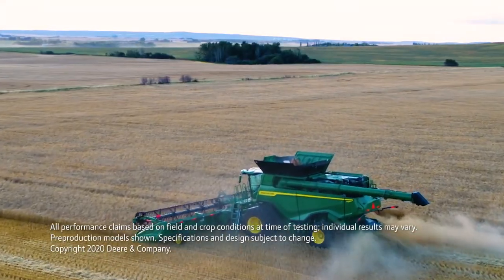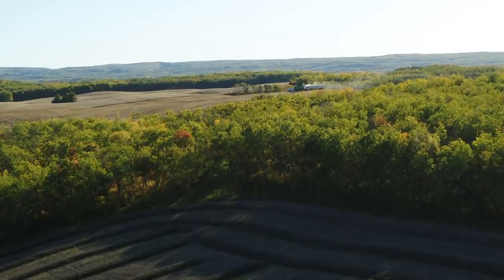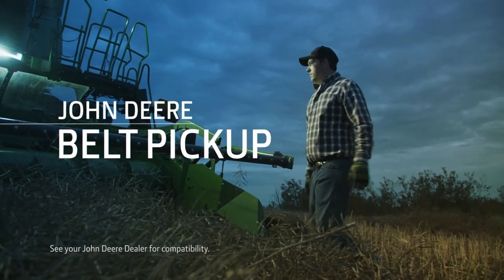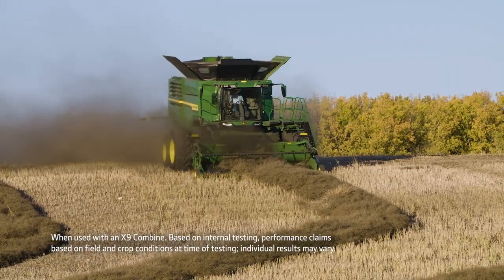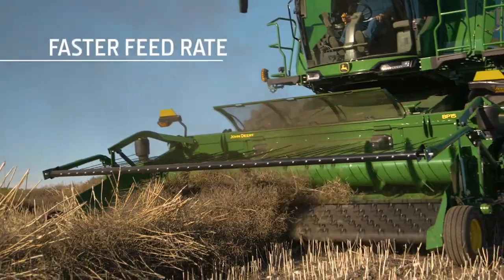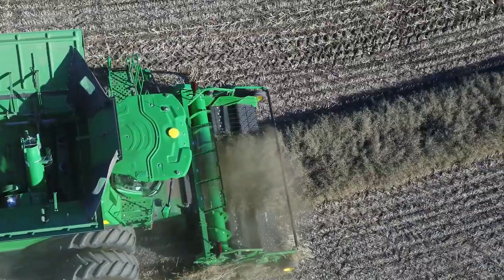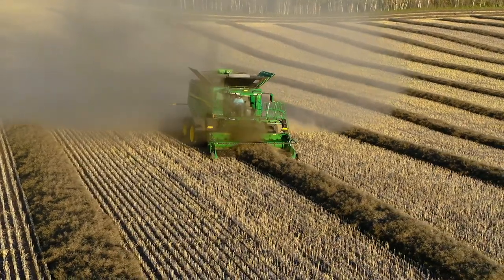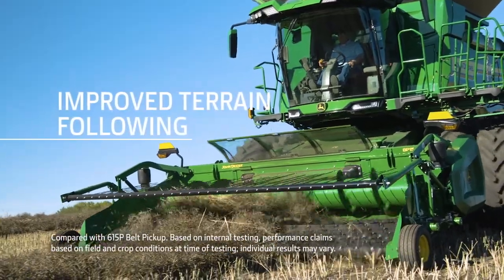For more details or to check compatibility, see your local John Deere dealer. For farmers who grow small grains and who need a belt pickup, we offer the BP-15. The BP-15 can pick up 30 acres of wheat or 23 acres of canola windrows an hour. A two-speed auger drive sprocket provides a 20% faster feed rate for canola and high yielding wheat. We also offer a feed auger spacer to keep the position of the auger high when harvesting large windrows. Larger gauge wheels with a no-tool adjustment offer improved terrain following in rough field conditions.